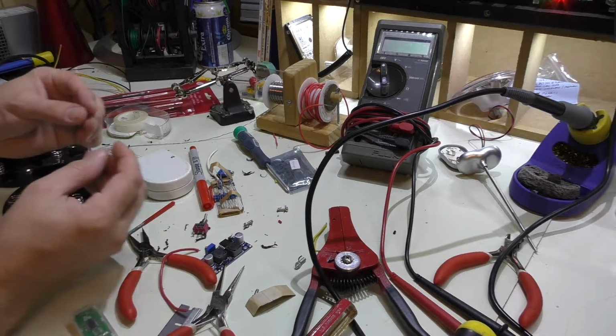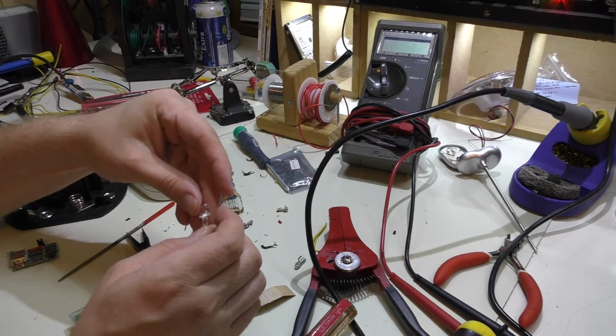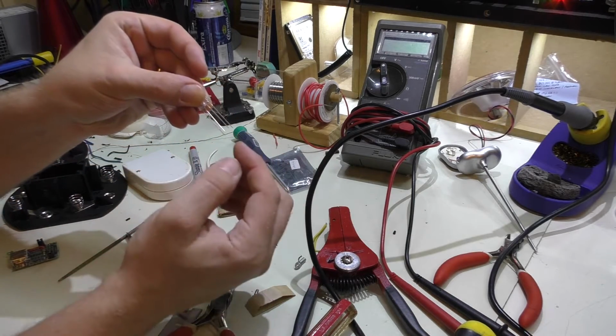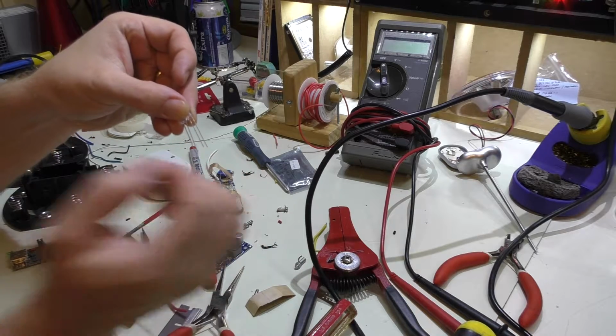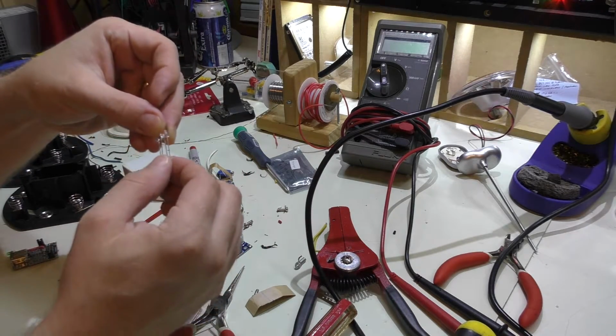And then the LEDs, I was thinking, if I'm going to use them together as a source of point light, I guess you could say, I'm going to connect it with the 2 negatives, or the ground wire, in the middle, and then the 2 positives on the outer side. And that way I could just connect it easier that way.